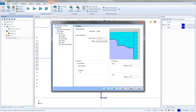So I'm going to go from stock. From custom lets you go in and type in a value, whatever value you want. I don't know if it's from center, but it's a value. That's where you're going to cut up to. I believe it's from center. So 2 inches from center down would be getting faced, but anything above 2 inches would get ignored. So we'll go from stock.